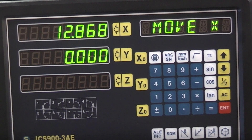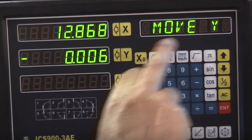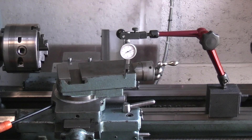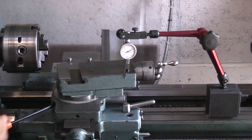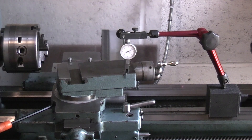It's taken me some time to figure out how this works. When you read the instructions I think it's more complicated than it need be. The key points are: start with your dial indicator at zero, move to the other end of the angle, set your dial indicator back to zero, press the white button and the computer will work out the angle that you've set the vise to. Now I've been experimenting on the lathe. On my Boxford I've got crinkle paint on here so it's not going to be too accurate, but if you've got a compound slide with a machined face on the front face then you should be able to use the slope feature on your digital readout.